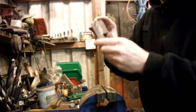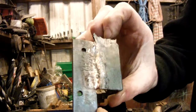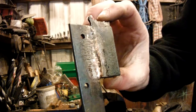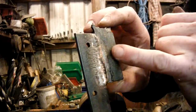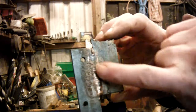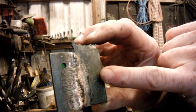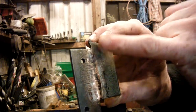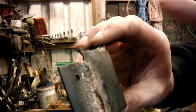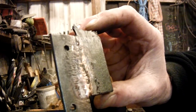That is a storming success. I don't know if that's showing up but that's a copper braze — it's pretty good. I had to get the steel a lot hotter than I would have expected. I've got no idea of actual temperatures, no way of gauging that other than noticing it had to go a little bit more orange than normal. And then once it was hot enough the copper just flowed really really nicely. You can see it's nicely beaded up on there and made what looks like a fairly strong bond.